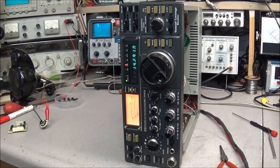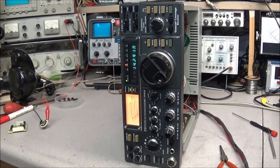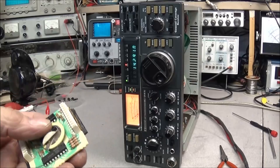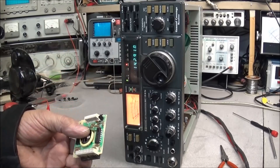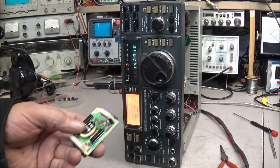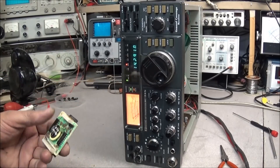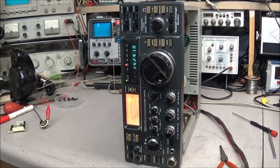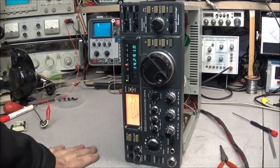Hello again everyone. As you all know, we're knee deep here in the radio shop with ICOM IC745s. We've been discussing the RAM boards that are inside the 745s, 751s, a couple of receivers, and a few other radios that use practically the same RAM board. This is version B of the RAM board — it has the two chips on it. When the battery goes dead, the radio basically becomes a brick and does not function anymore, because the base program that holds the frequency scheme and your 32 memories is inside that RAM board.